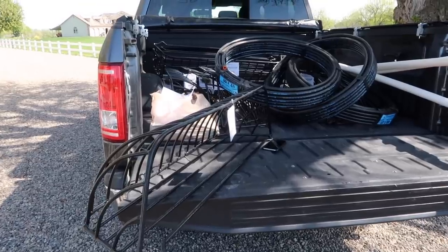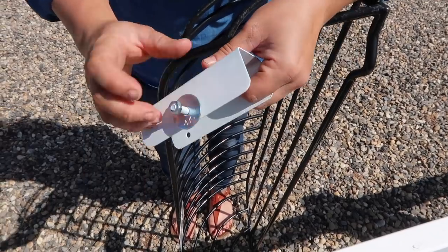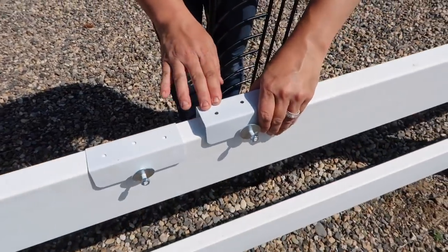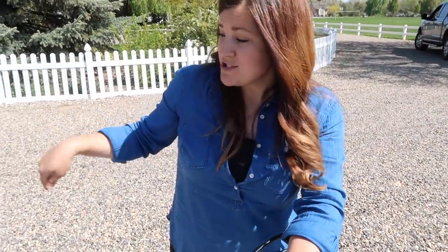We also have the liners which we'll bring out when we're all done installing them. We had to make our own brackets for this fence because there are specific railing brackets if you're putting this type of basket on a deck. But decks usually have a good-sized railing and this fence is a lot more narrow so those brackets didn't fit. There are also specific wall brackets if you're attaching it to a home, which we'll cover in a later video. So for the fence, these are brackets for 2x4s usually used in construction — they come in silver from the hardware store but we had them painted white. We put a 5/8-inch hole drilled through the bracket and a quarter-inch bolt with a couple of nuts and a big washer. The bracket just slips right over the fence perfectly snug, and I love that it's white so it disappears on the fence since we see this fence from both sides.